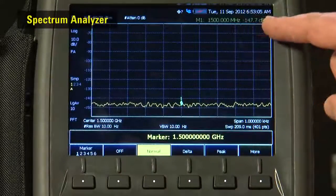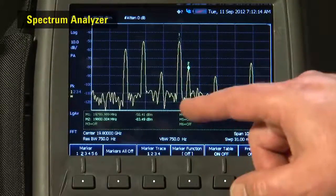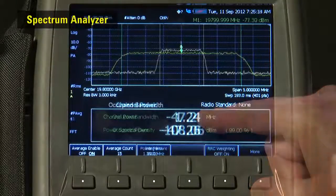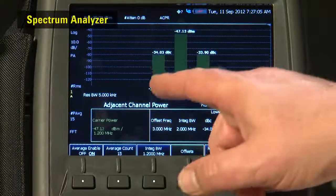There is an extremely high performance spectrum analyzer, with amplitude accuracy comparable to many benchtop units, and phase noise and third order intermodulation performance exceeding what you should expect in a handheld instrument. The spectrum analyzer even tunes down to 5kHz, so it covers everything from VLF right through to the microwave bands.